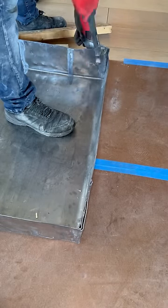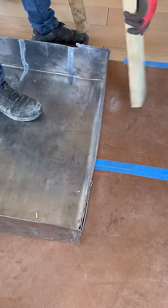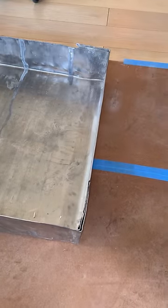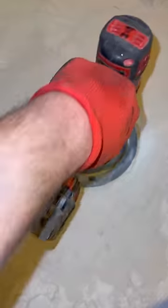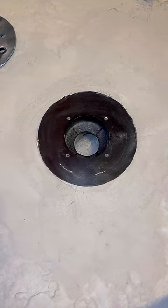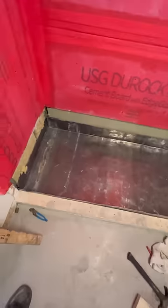To find the drain hole, I apply pressure with my hand to locate it. Then with the hammer, I hit it multiple times until the hole opens up. By doing so, I'm also shaping the lead into the side of the drain to ensure better coverage. After banging the sides into the drain, I cut out the small piece and drill out the holes for the screws with the tip of a Phillips head. I use that because I want to keep the holes minimally open so we don't create leaks. While I'm doing that, my guy is mixing some fresh epoxy to close all the holes where the water could leak out. I usually use a different kind of epoxy, but the supply was out that day — the other one dries faster. This JB Weld takes 24 hours to cure, but I'm sure it does its job. So I screw in the flange and apply the epoxy on the screws and where the lead meets the drain. The masterpiece is complete.